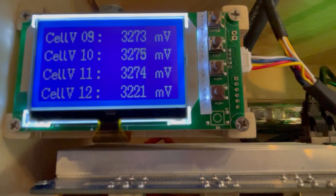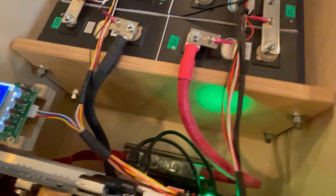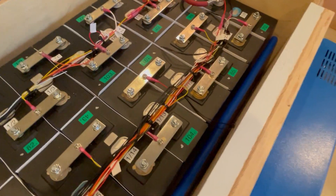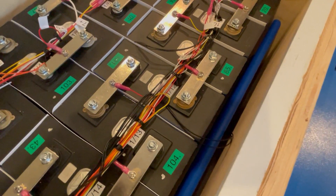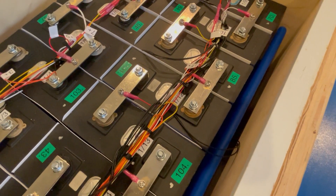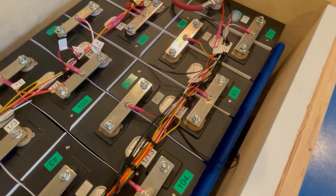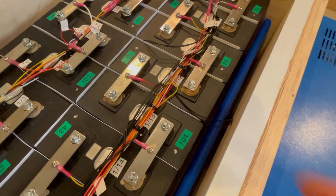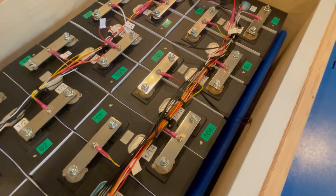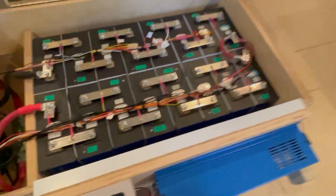But it certainly is — it's racing to the bottom. So what I'm going to do: once this test is complete, I will charge this battery back up, and when I get it back towards full, I'll take a spare cell, charge it to full, and replace cell number 12 to get this battery pack to where it doesn't have a runner in it. I'll continue to do that with all 12 of these batteries.